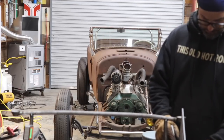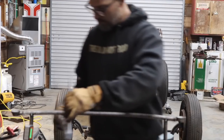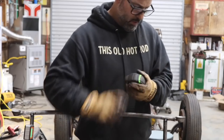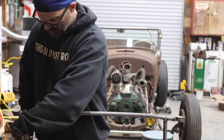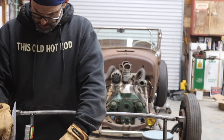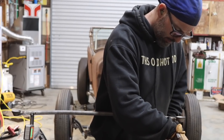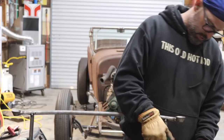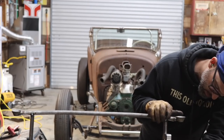Moving it up two inches moved it quite a bit — let me see where it's at now. Four and three eighths on one side, about four and a half on the other — so I'm like a sixteenth off now. That made all the difference. I'm at 78.9 on one side and 79.9 on the other — close enough.